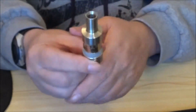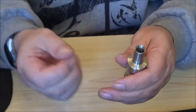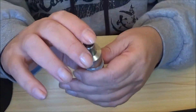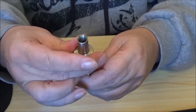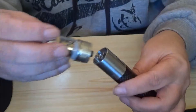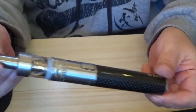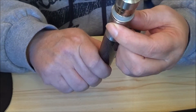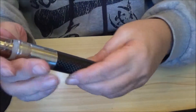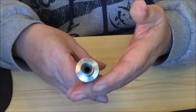A bit of a safety warning - don't try and fire this on an ego battery. It's got to be fired on a high drain battery, otherwise the battery might vent and explode. I've heard of people putting them on ego batteries where it's not fired at all, and others where it's exploded. Anyway, this is the pair of them together - it is a nice little unit. The tank looks right on the battery, which is one of the big points I look for. Let's go back up top and I'll demonstrate it for you on various airflow settings.